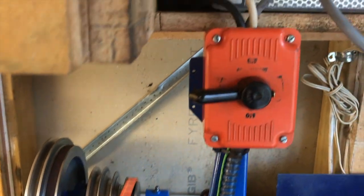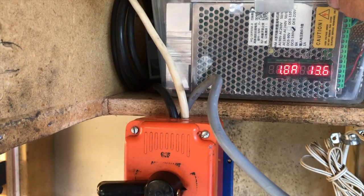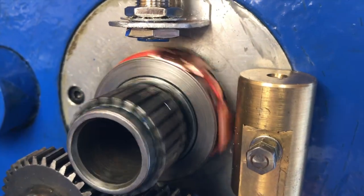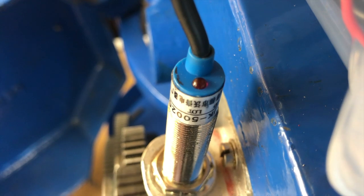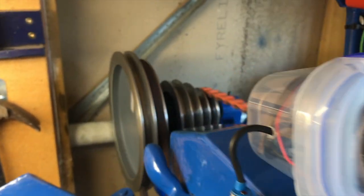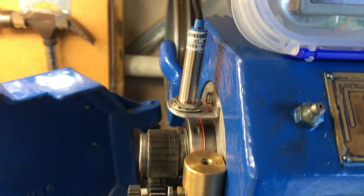And even more slowly — 85 RPM. Let's have a look at how this works. It has a little magnet that I've mounted on the spindle, and when it goes past the sensor, it sends a signal that you can see blinking on the little LED on top. And then of course this displays a digital RPM reading. It's ticking over slowly now.